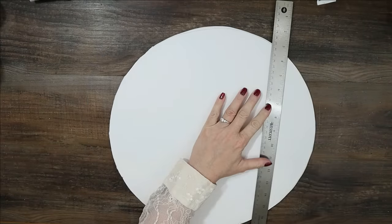If you're someone that doesn't want that chippy look or that rustic look, I recommend that you use a primer for this, because especially the little lantern, it was really, really shiny. I don't even think Waverly chalk paint would stick really well. I mean, you could use Waverly and then just seal it up with some Mod Podge or a polyacrylic clear spray of some kind, but I'm just letting you know that the surfaces definitely wanted to let go of the paint.